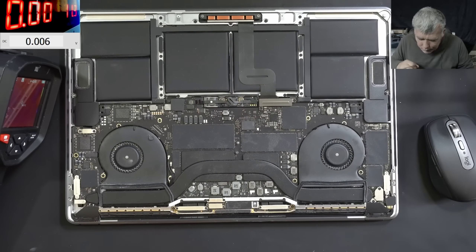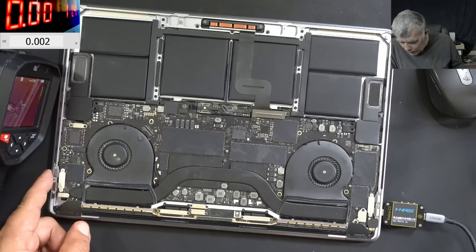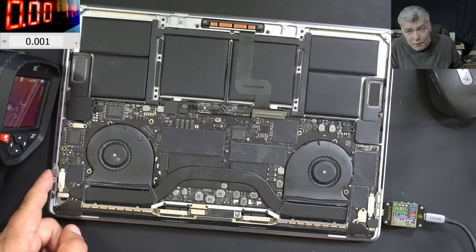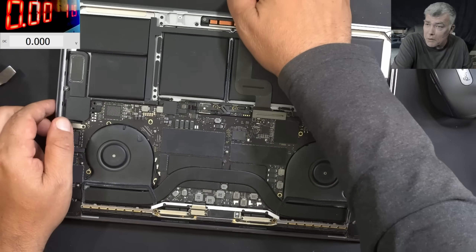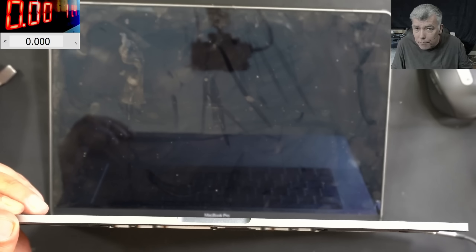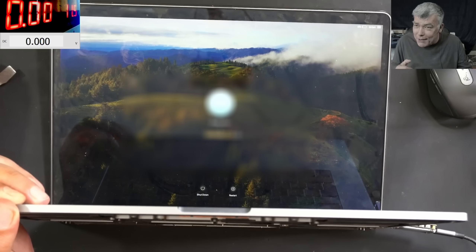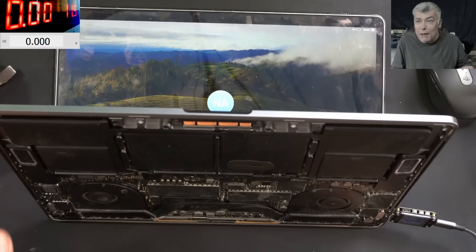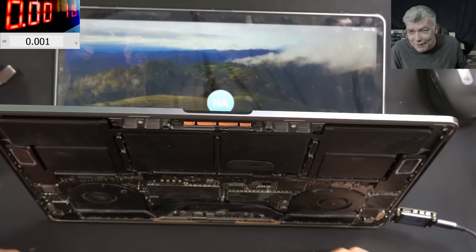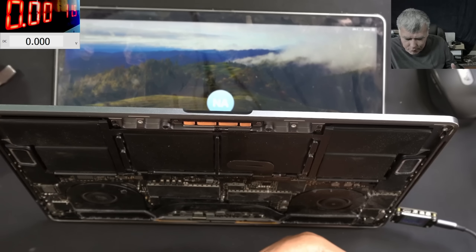So what do you think about that? Plug in the charger — we have 19 volts with 600 milliamps, 1.6 amps. The laptop is coming on. 2 amps. We have a picture — we fixed it! So anyone figured out what happened there? This was like a few seconds fix. We figured it out: it's a capacitor, not a MOSFET. We checked the coils, we had zero volts, so everything was fine.